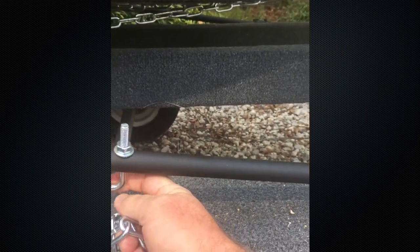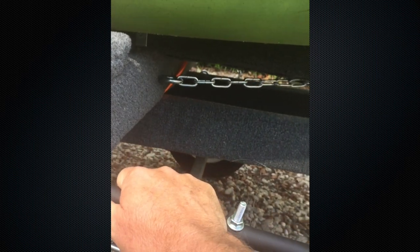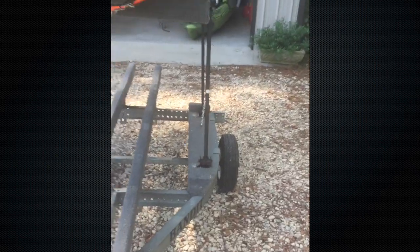This chain is just a metal hook I picked up at Lowe's — I drilled a hole through the gas pipe and put it in. The chain acts as a stop, and I have one on each side, that allows the platform to raise but won't allow it to go all the way forward and fall onto the winch. Let's raise this back up for a better look. When you get ready to bring it up, all you've got to do is winch it up. When the stop chains pull tight, you put a little tension on it and it's up.